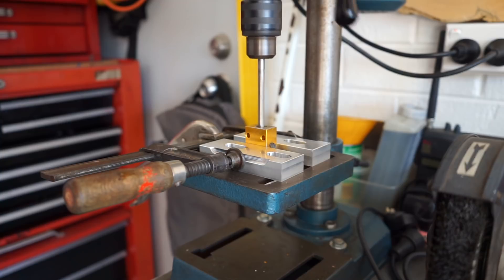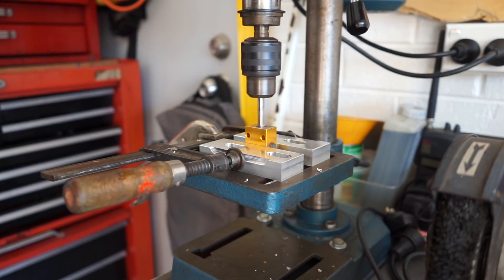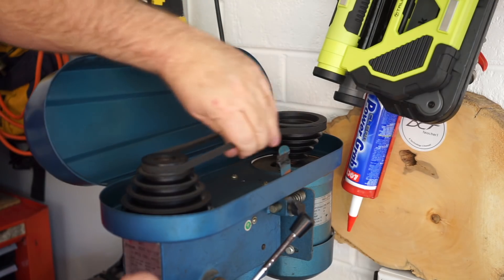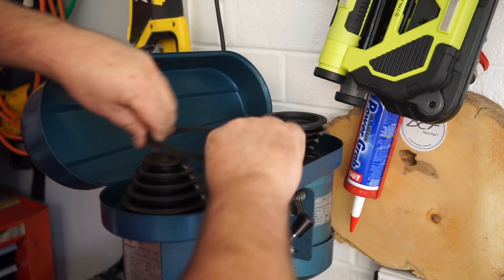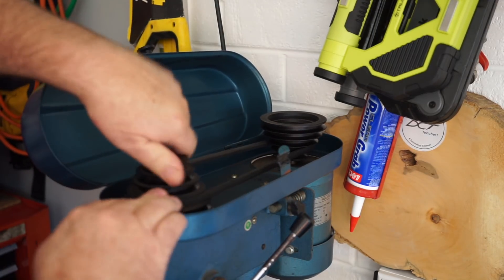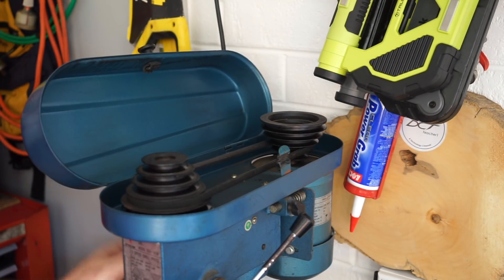You'll like my humpty dumpty drill vise here — I had to give my drill vise back, I was only borrowing it, and I had no way of clamping this. So I used a couple of soft jaws. My little bench drill was running flat out, and I was going to push it with just under a half inch drill bit — 11.5mm — so I had to get the RPM down to around 800 RPM.